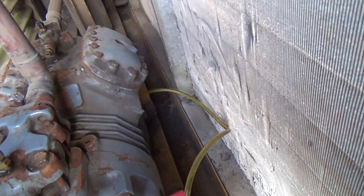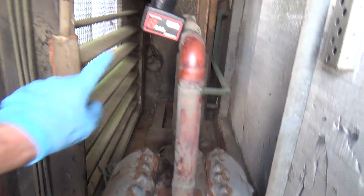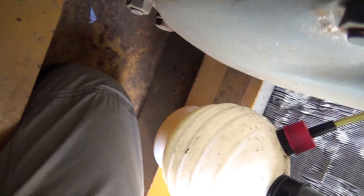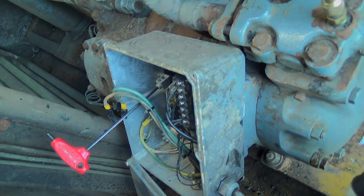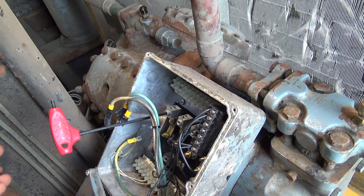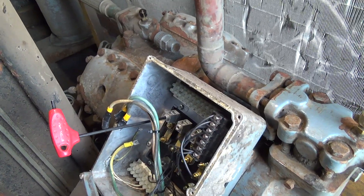I think these hold three or four liters. Some of the oil might be around the system because it would have gone when it was short of gas — there could be some in the accumulator or in the coils. We'll see how much we get out and put about the same amount back in. Right, there wasn't much in it so we suspect it's around the system. We've put enough in that it's above the minimum but not maximum, so we'll run it and see if the oil comes back.